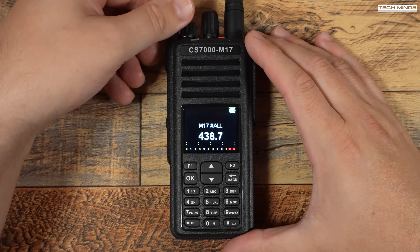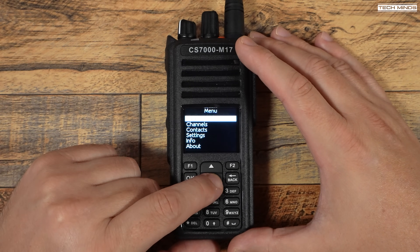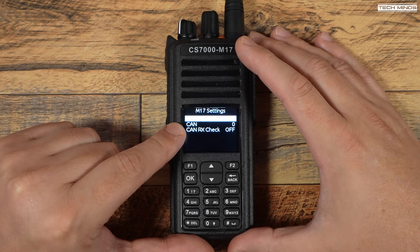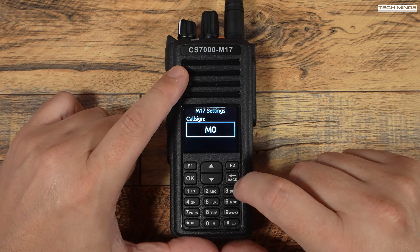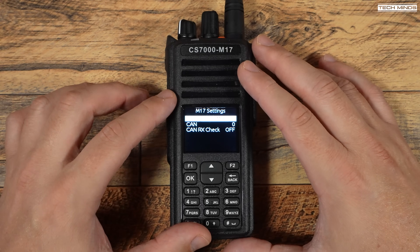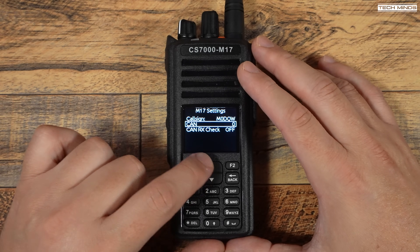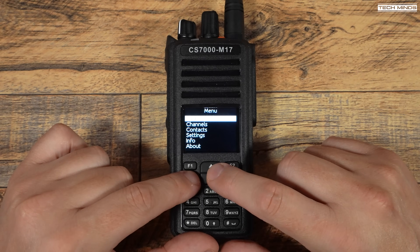Turn the radio off and back on again. Assuming everything went well, you'll be presented with the OpenRTX logo as the radio boots up. One of the first things to do is program your callsign into the radio through the menu system — pressing OK enters the menu. One of the great things about M17 is that there is no central database of callsigns needed; the programmed callsign is sent as part of the M17 transmission, similar to how Fusion, D-STAR, and DMR talker alias works. The CAN setting — a number between 0 and 15 — is the Channel Access Number, think of it like CTCSS or DCS on analog; I've just set mine to zero.